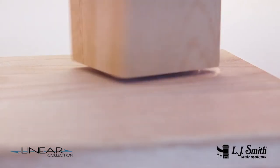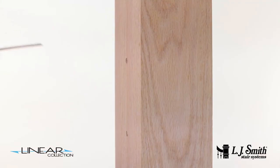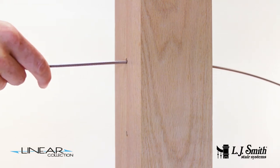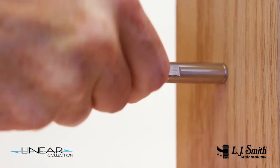To keep the recommended 42 inch spacing between newels on any level run, an intermediate newel may be placed at the midpoint. Run the cut end of the cable through the level pass-through newel and insert the cable end into the level fixed fitting.